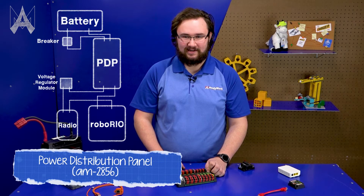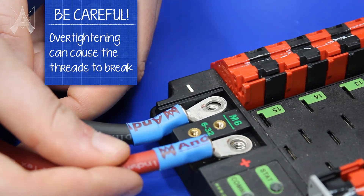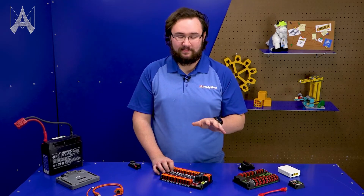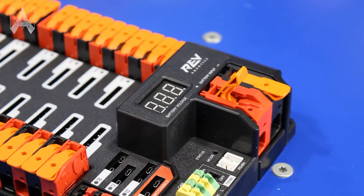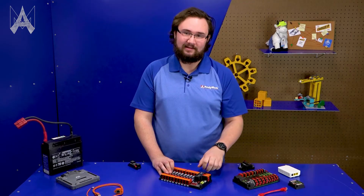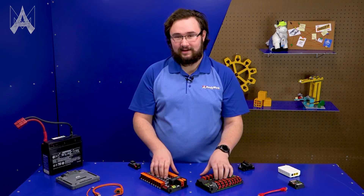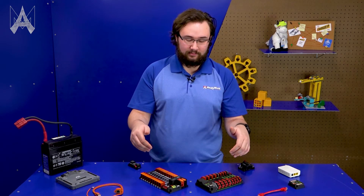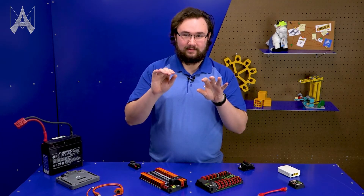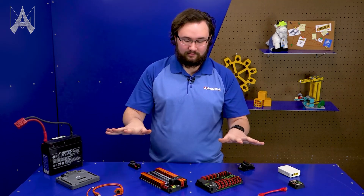On the Cross the Road Electronics Power Distribution Panel, the battery is connected underneath a plastic cover with two M6 screws. On the Rev Robotics Power Distribution Hub, the connector is a little different — just strip back the wires in your battery cable and connect them into the large WAGO connectors. These connections are super robust, but you still want to give them a big tug test to make sure everything's good to go. Neither of these power distribution boards require any soldering or tinning of wires.